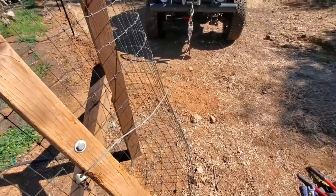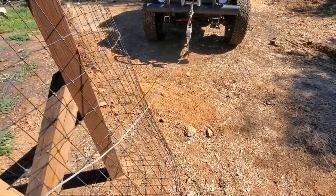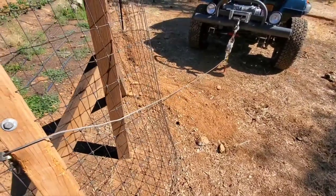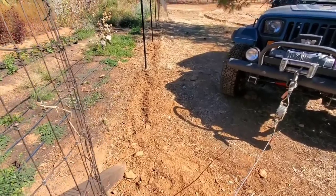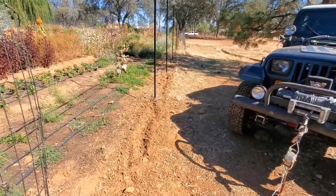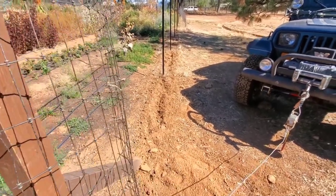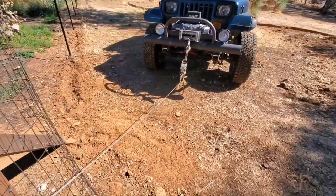Okay, next step here, I've got the come along hooked up to my Jeep. Now, if you did not have a vehicle or could not get a vehicle out to where you were, you have to get creative. So you may need a long piece of chain and go to a tree, or if you were on a long run and there was virtually nothing to pull and you couldn't get a vehicle, you would have to pull to your next concrete pole. Just wrap your chain around the base of a pole, like way down there, that next one. And then you would pull to the base of that and hopefully it won't pull out your post or snap it off. It can happen, but if you keep it down low and don't go too crazy, you generally could do that. But I am able to get a vehicle close.